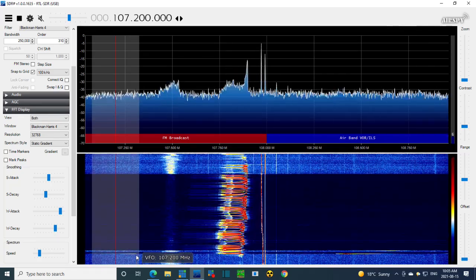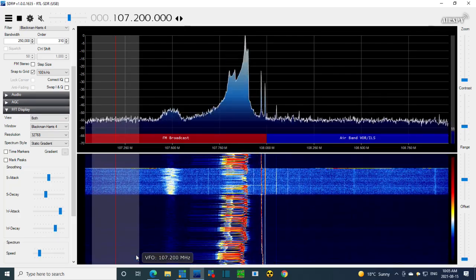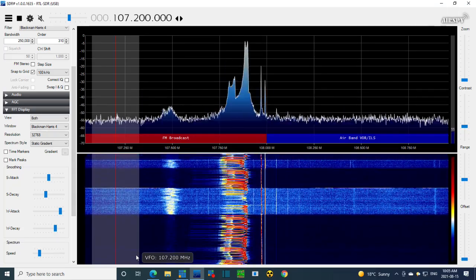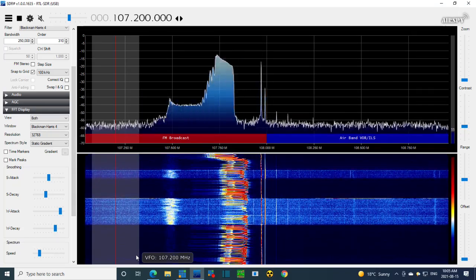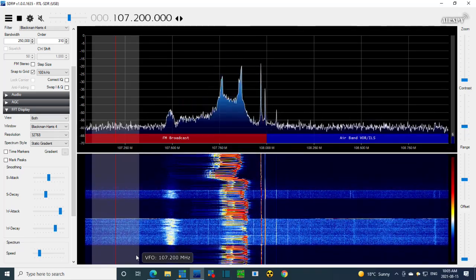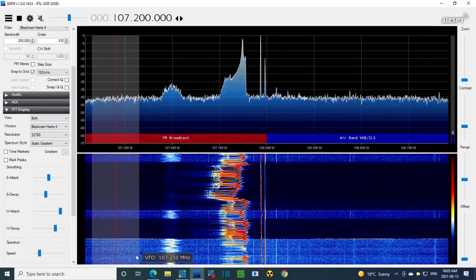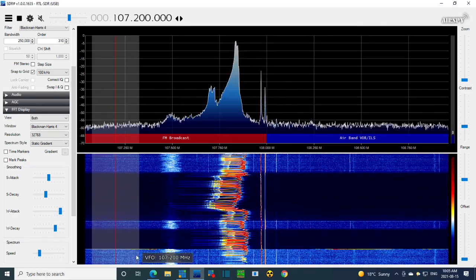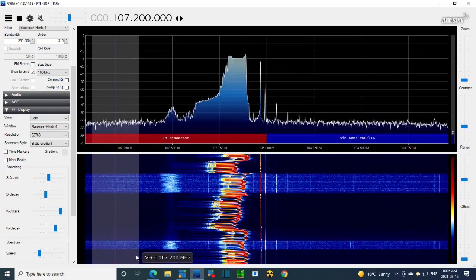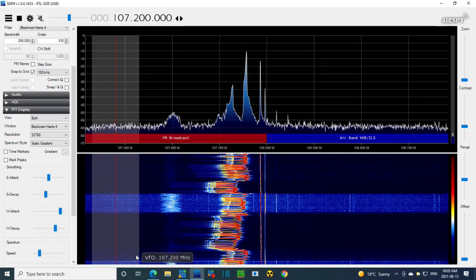Yeah, it definitely gets lower and higher, and then the vernier or the adjustable. You can see the SDR is compensating for the variation in the signal strength by turning its own level control up and down. That's why the general noise level is going up and down. Like that's low signal, high noise, and then when you put high signal, you can see the noise goes down. So the SDR is doing things too. That's the bottom line. Okay, so sweep width is minimal right now.